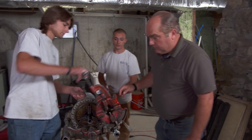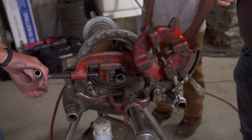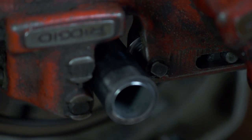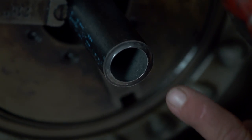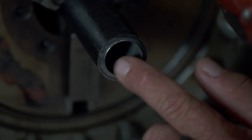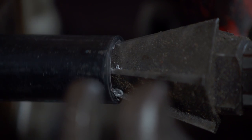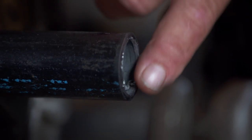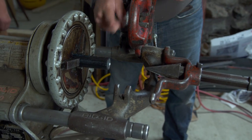With the power drive, the pipe turns and you cut, thread, and ream it. Zach takes the cutter, tightens it up, and turns the drive on — a little bit of tightening at a time. Once it's cut, there's still a raw edge that adds friction, so you have to deburr it with a reaming tool. After reaming, you can see how nice and clean the inside is, but we're not done yet — we still have to cut threads into the pipe.